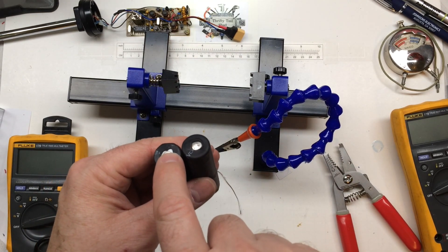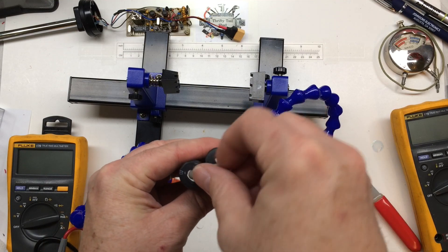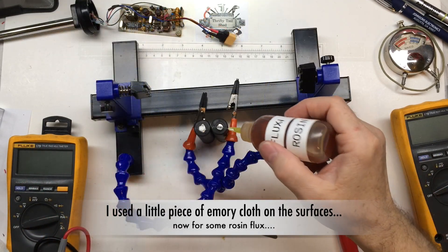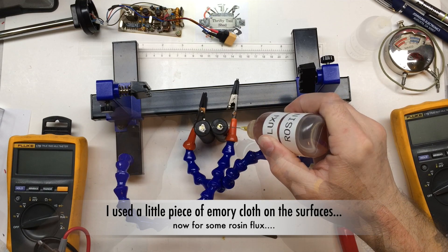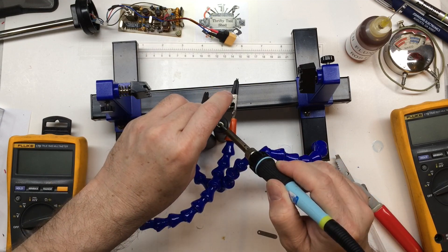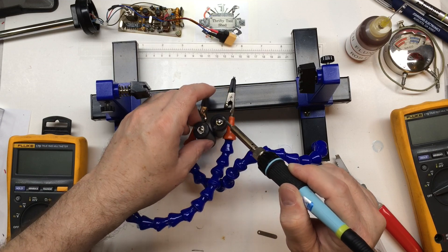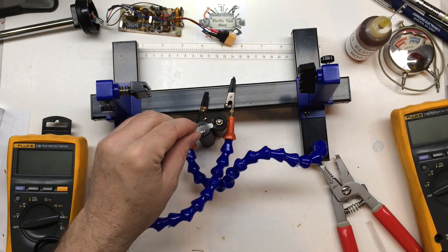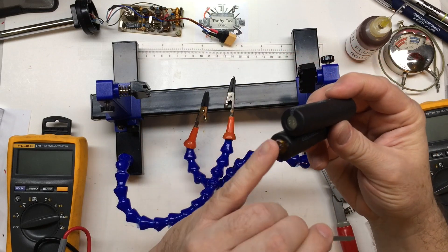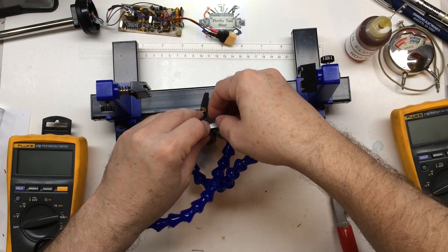I'm going to take the positive side that I did the extra protection on and the negative side of the other battery, and put them together because I'm making this an 8.4-volt pack when fully charged, so around 8 volts. I'll put a strip to connect the plus and minus together in series. You just have to be mindful of where you're putting your batteries — you can't put them on metal as I put this strip on, or you'd be shorting out the 8 volts across the battery.